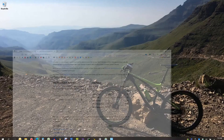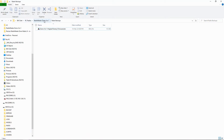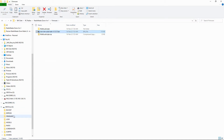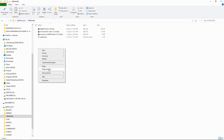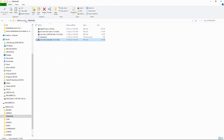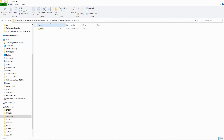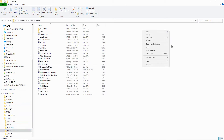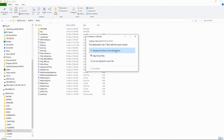Let's plug in and select storage on the radio. Now we go back to where we downloaded the firmware. All we need to do is take the firmware bin file, copy that, and take it over to the USB drive for your radio. Do not go into the RM0 directory — leave that alone, completely do not touch that. We go to the firmware folder and paste it in there. Now for the Lua scripts, we need to take the scripts — the directory is multi, multi Lua scripts, scripts and tools. Select all of those, then go to the same directory within the SD card: scripts and then tools. Right-click and paste those files in. It may say replace — just replace.